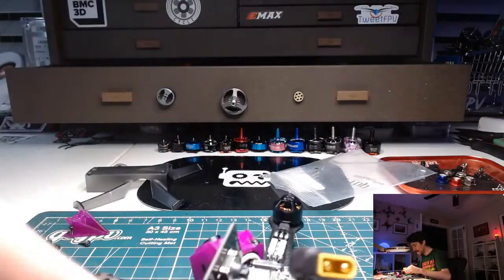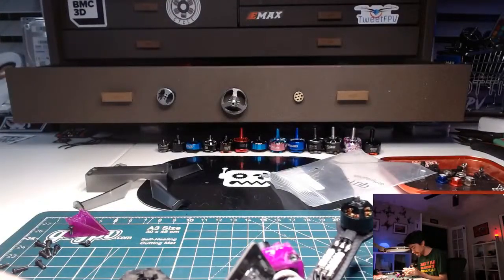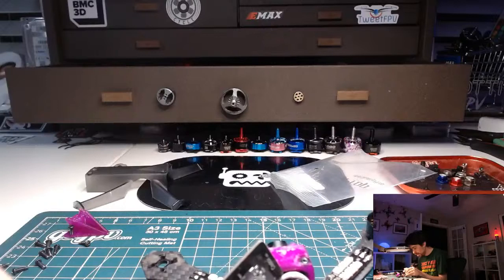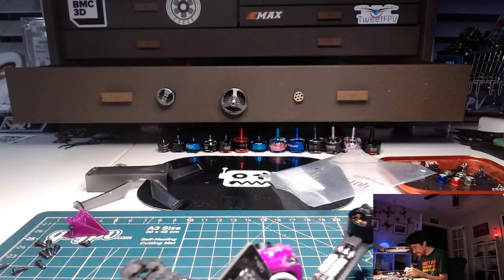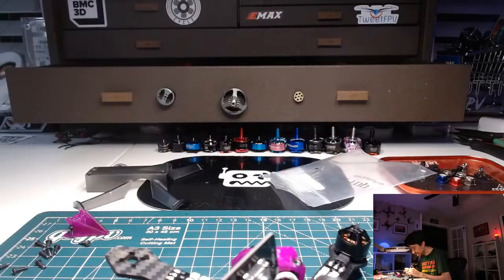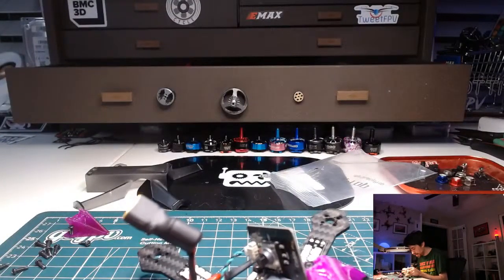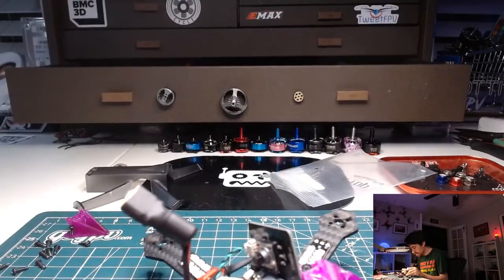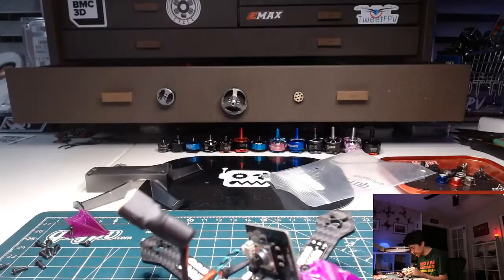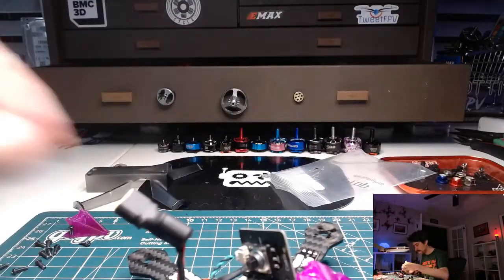But yeah, I think at some point I might actually take the HD out of this and throw in that Phoenix Nano I have just sitting here waiting for some love, and that thing would be perfect in here. The frame has a purpose, and I'm outside of that purpose with a camera that's almost impossible to fly through. I'm willing to make sacrifices for HD, but not being able to see in the FPV feed is a rough sacrifice. If it was some kind of cinematic rig, I guess that would be a sacrifice you could make, but it's not. So yeah, don't build yours with HD.